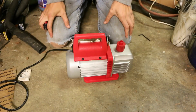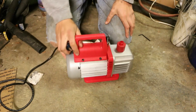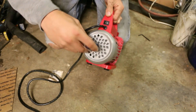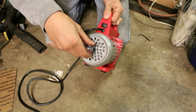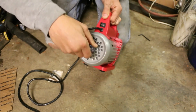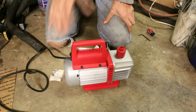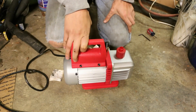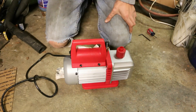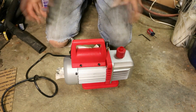I've had this vacuum pump for a little over a year, maybe two years. It's a Cozy Vacuum TA-350 — a pretty cheap little pump. On this end we have an access port to reach into the electric motor, and if I get the screwdriver to slot in, that's all the turning it'll do. Back and forth, maybe a sixteenth of a turn — not even an eighth or a quarter — and it is locked up solid in either direction past that. If you plug it in and switch it on, it just goes to that point, trips the overload, shuts off until you toggle it back on and off, and then it repeats.